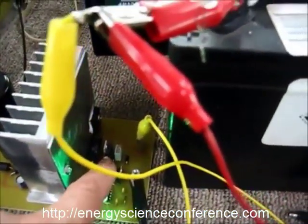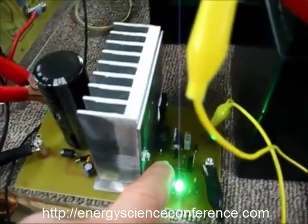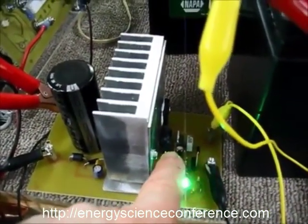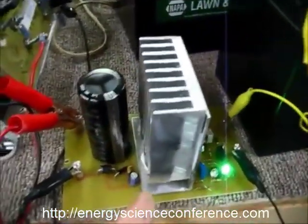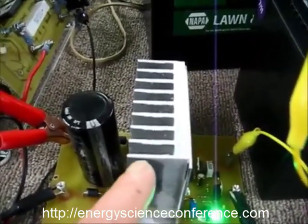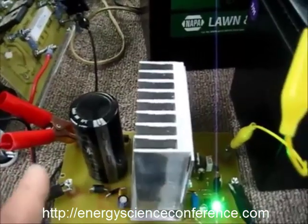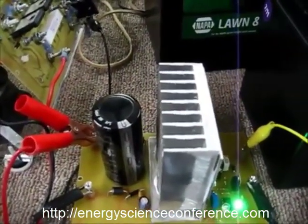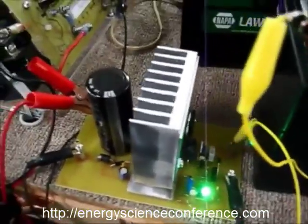This is adjustable, so you can adjust the voltage on the regulator and the amplifier. Here's the amplifier itself — the device for the amplifier — and the linear circuits are over here, and the comparator circuits are over here. Underneath here are TO3 devices, and they make up this series pass Darlington, basically, and then the filter. That filter is Zener-controlled so the device can't go over 30 volts, and the battery will just sit here and float at about 15 volts, 15.1, when it's fully charged.